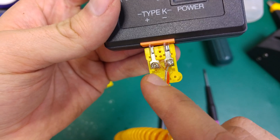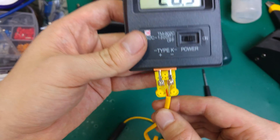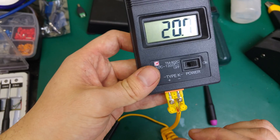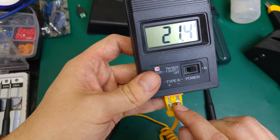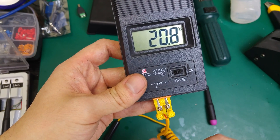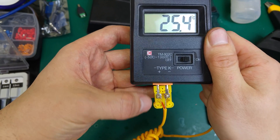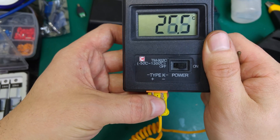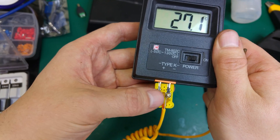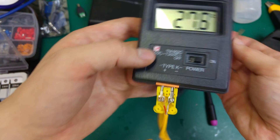What our Chinese friends did is this — as you can see, the wires are touching each other and that changes the resistance of the probe. So from that you get different results, because it's touching a little bit and as you can see it's affecting the reading. Over here you might get a good temperature, but if that wire starts touching it changes the resistance.